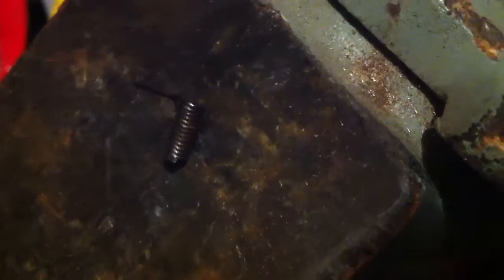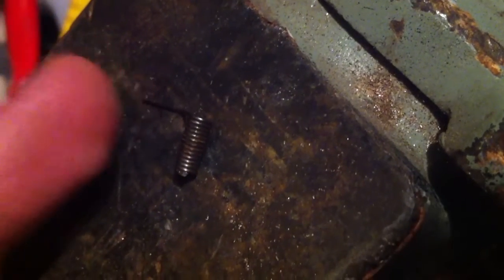That spring is fine, except along with that foot coming off, it should have one on this side, so that it creates an opening kind of movement. So I'm going to recreate basically this spring exactly by wrapping it around this post, which is mounted in this vise, and I'm going to have the two fingers coming off.